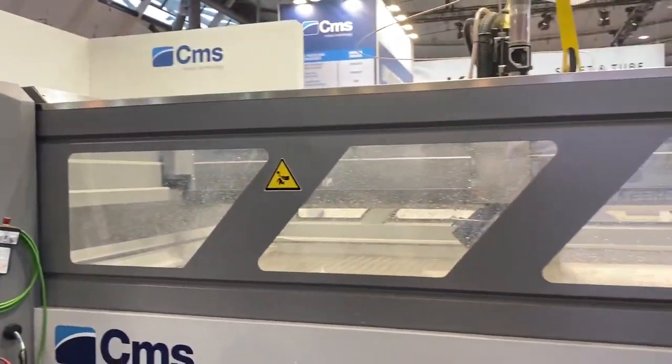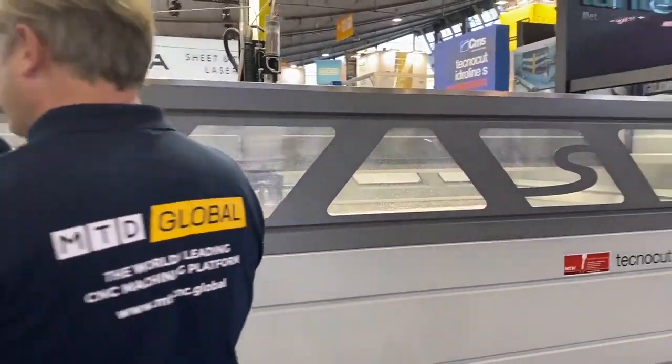So it's a very effective and cheap system to remove the abrasive from the tank. So like a machine tool such as a lathe or a mill, keeping that spindle turning, you're keeping this water jet cutting by constant cleaning in the working envelope. Yeah, correct. I think that's really something that any user of a water jet should have, because that's really handy.